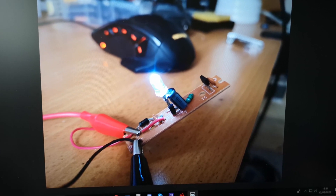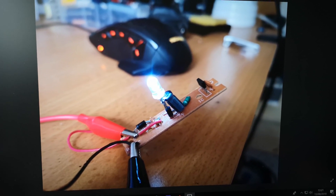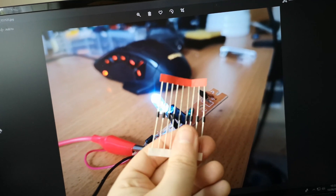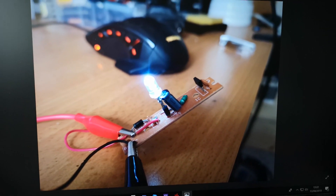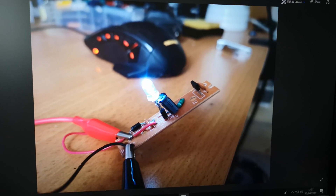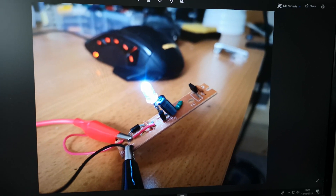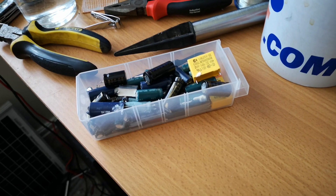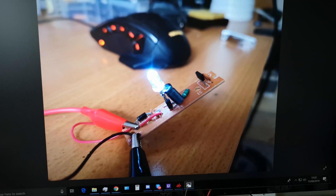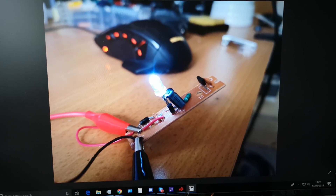If you want to add a diode, it's going to incur a voltage drop, so you need a very low voltage drop diode. The one I've got in there is a 1N5817 — it's actually a one-amp diode, which is a bit overkill, but at the current in question the forward voltage drop is only about 0.22 volts, which is pretty low. The capacitor is also a bit overkill — it's a salvage capacitor that came from power supplies I've been dismantling recently, something like a 50-volt 22-microfarad. Overkill, but it does the job.